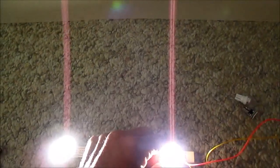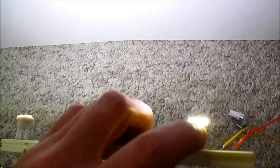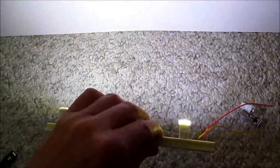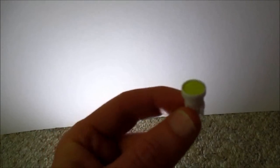However, as you remember, this one draws 0.72 watts, if I remember correctly, versus about 1/2 a watt. So this is using a lot more power, and it's not as good. Another problem with this bulb, it gets really hot. Now this is a small package, even though it's less than a watt, 0.72 watts consumption. Some of that is turned into heat. This one gets hot to the point that it's starting to give off an odor. So this bulb is a fail. I would not recommend it.